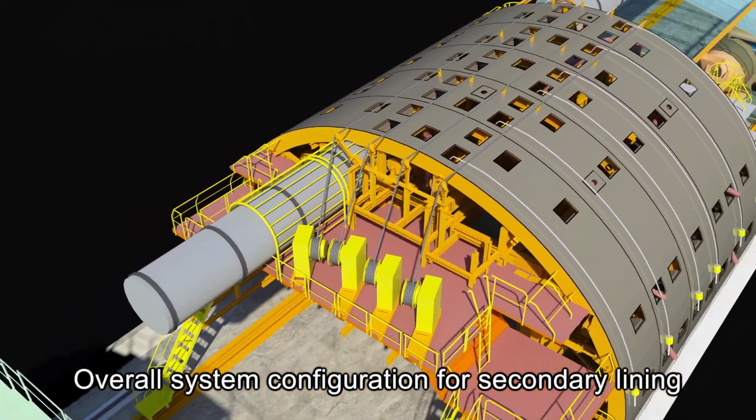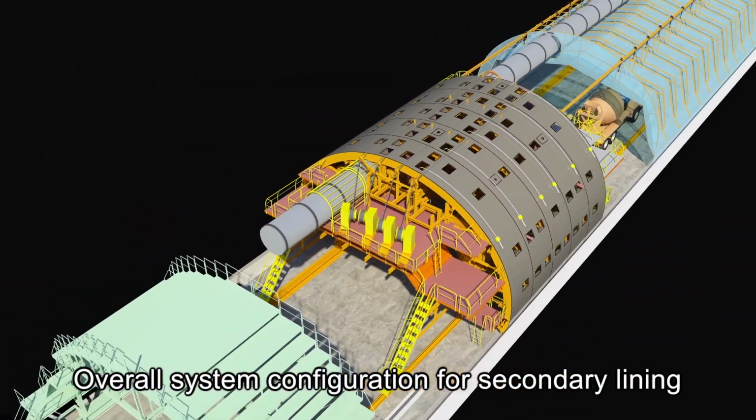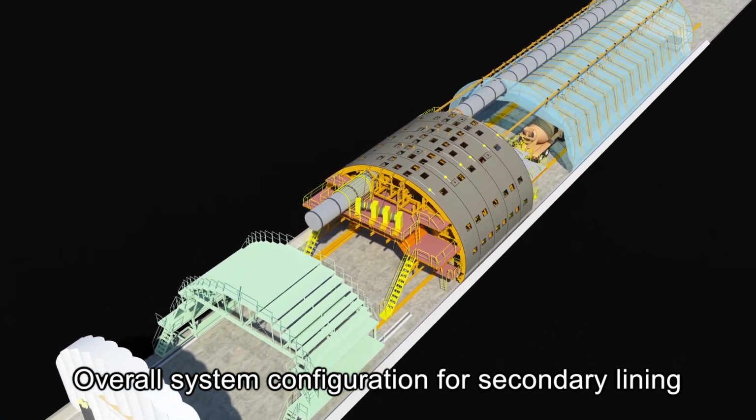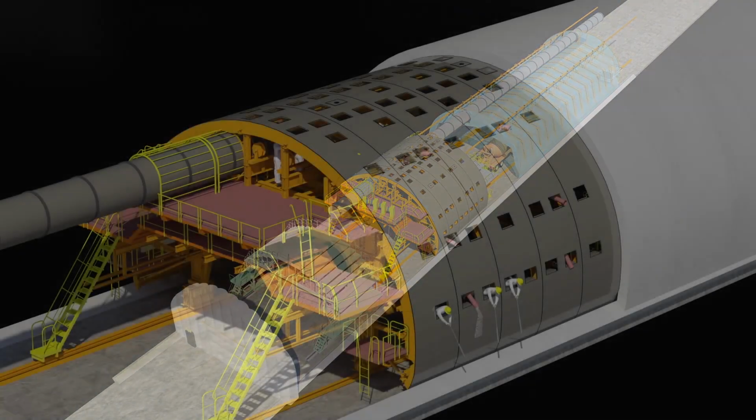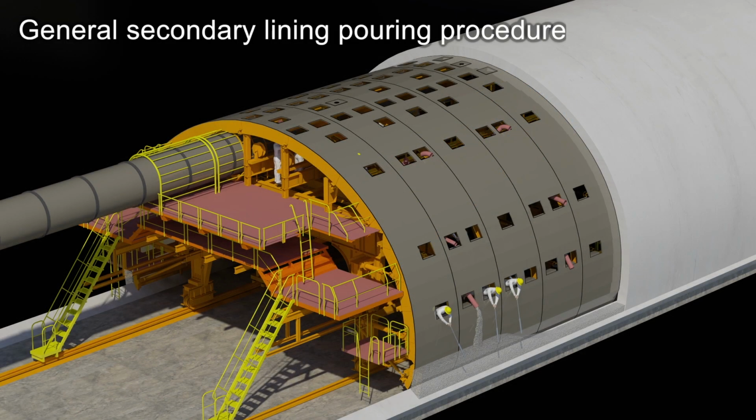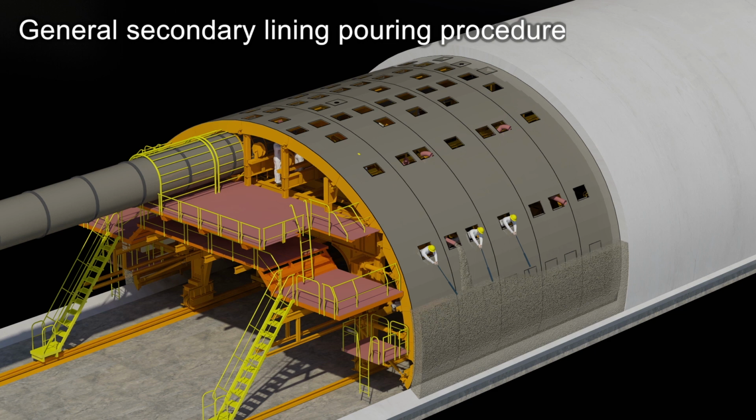Now, let's take a look at and compare the lining method proposed here with a lining method that is generally used. The general method for lining tunnels using the new Austrian tunneling method involves pouring concrete from inspection windows positioned on the formwork into the sidewalls and up to the arched section. Concrete is then poured into the crown part.